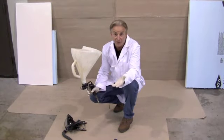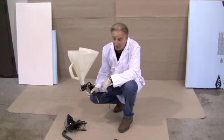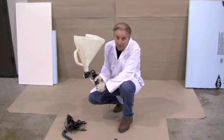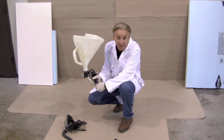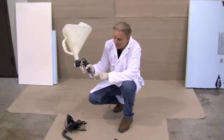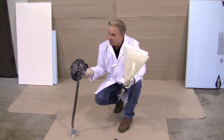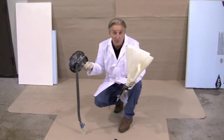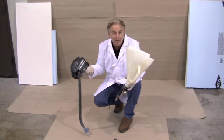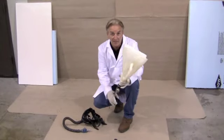Out in the shop now, we're actually going to do some spraying with the Styro Spray 1000. We've got the hopper gun and we want to adjust the travel of the handle to give a short range — we don't need all the range and we don't want to flood the piece or it'll spatter too much. We've got the air valve and the supplied air mask, which is really the only one we recommend when spraying. For this application, I'm going to use simple latex gloves.